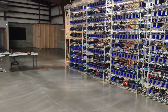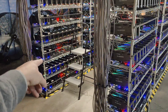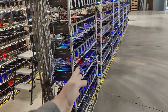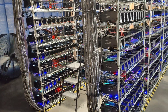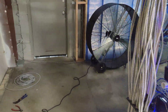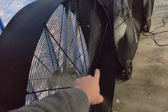Anyway, after doing that we are now able to run at maximum speed. These fans over here are the exhaust — let me show you guys around this area, the other side of the fans. This gives you an idea of how we're drawing the air — pulling it through the first row, a layer of heat dissipates between, and whatever is left goes to the second layer and goes out the exhaust. It does a really good job; it's really cool in here. You don't feel the heat at all — when you open the door and walk in you actually don't feel it, because this exhaust does a great job of blowing out all that hot air. These fans run at a very fast rate, sucking in a lot of air and blowing it right past the rigs, so the rigs stay nice and cool.